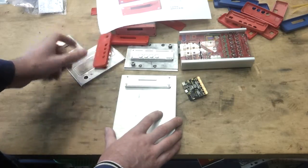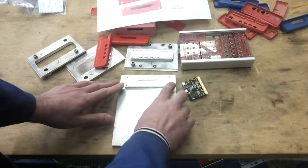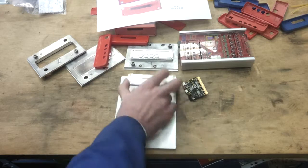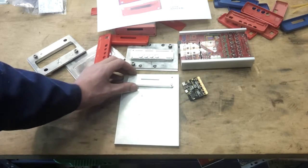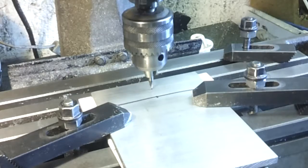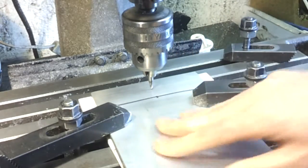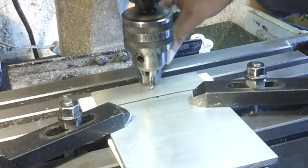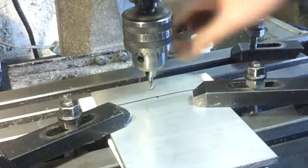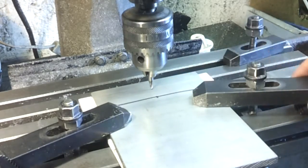He only wants probably about a hundred of these, so it's a couple of hours of molding, but to get there we're probably looking at a few hours of machining to chop this down, make a new insert, and put a couple of threaded holes on the back. So we've got the plate on the machine — I think we'll be okay clamping it just here, and then when we get to the end for the final pocketing we'll be able to swing a clamp in there and come in on that slot where the header goes, and that should hold it in place for the last bit. I might be able to swing some extra clamps in just for good measure.